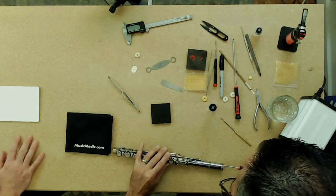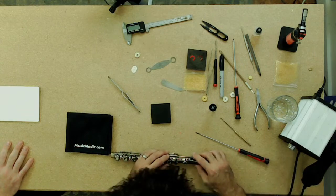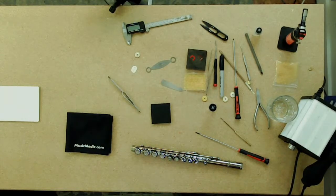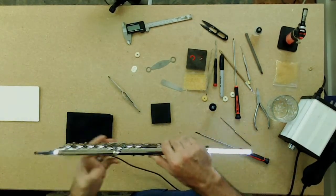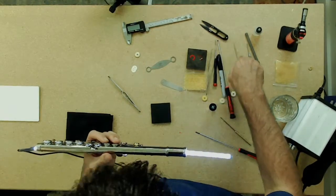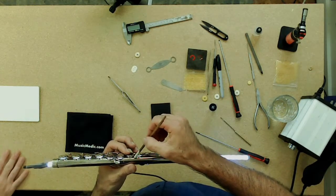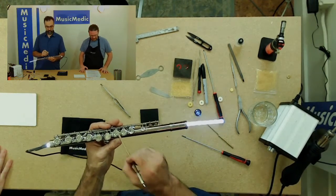We're going to check that area where there was light — where you put the shim in. I'm going to check it again with a leak light and a feeler gauge, double checking. There are plenty of times when you have to go back and forth — it may still have a leak, or there may still be a leak on the same side. It's a back and forth process — there's never anything definitive about shimming, but the more you do it, the easier it gets. I think I got a little lucky on this one. It's a little bit light, but it actually is grabbing — that's a huge plus. I would probably take this back off, put a 1,000th shim in there, and then be 100% done with that pad.